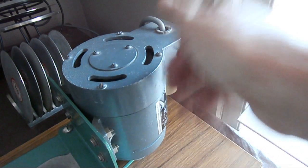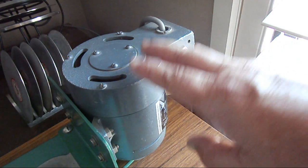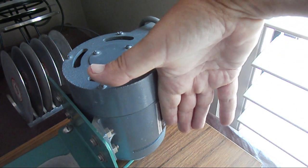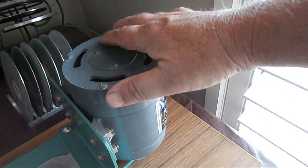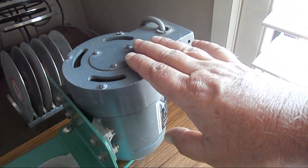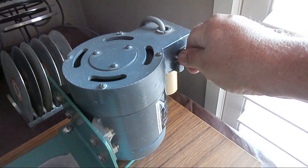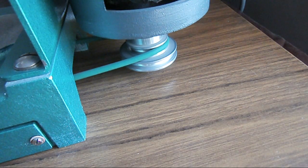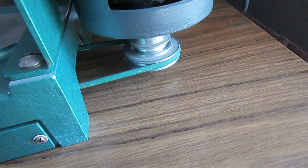It's interesting that faceting machine designers put very little thought into the motor. As you can see by the size of my motor compared to my hand, it's absolutely huge — this means I can cut any size gem and it will tear through large gems quickly. Some faceters use a two-handed approach, pressing hard down on the plate, which means the motor isn't strong enough for large gems and they're just stressing the head of the machine. Another design flaw I've noticed is that many machines house their motor in a box underneath — if you're living in a hot country like Australia, that motor has a very high tendency to overheat, so it's best to have the motor out in the open so it can ventilate.